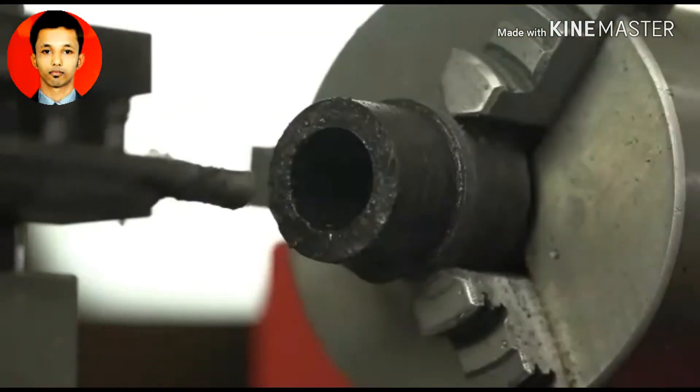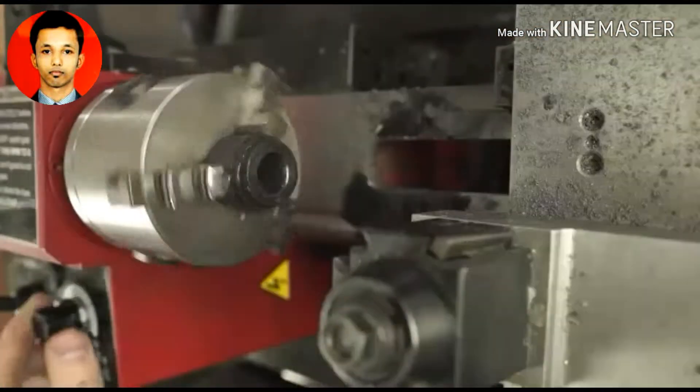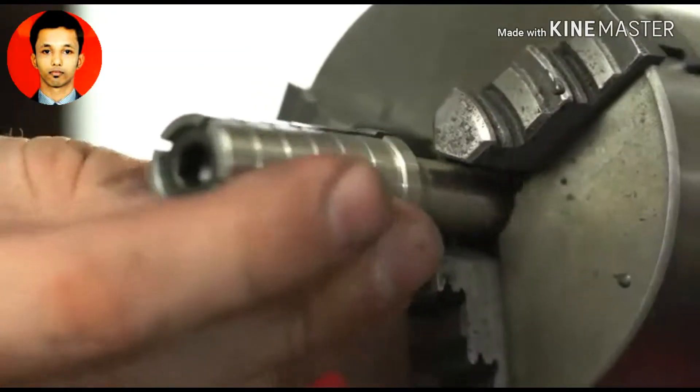What forged carbon fiber does, by having all of the material blended in there, there's no large weak areas like the standard stacked carbon fiber would have. So in practice, this means that forged carbon fiber is a lot easier to machine without having to worry about it splitting or chipping, anything like that.